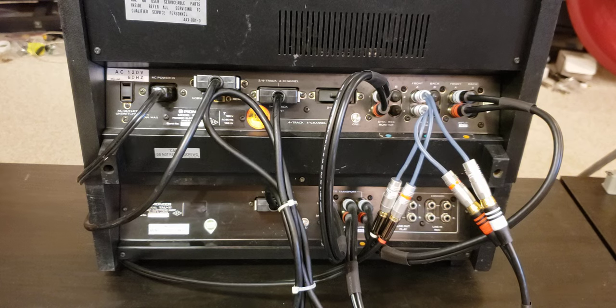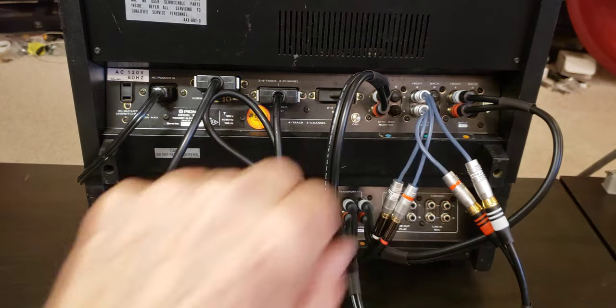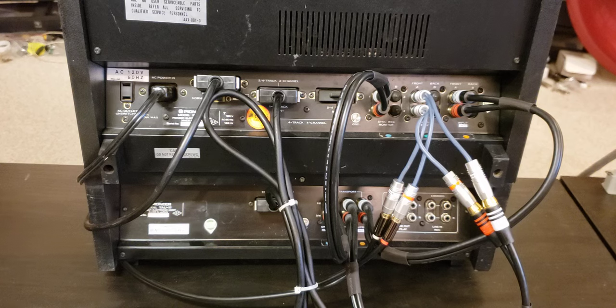And there are two ways of doing it. One way is simply to plug an external amplifier into this connector. That will work marvelously well. The only issue is that you have a little bit less signal than you get out of the line output. So your preamplifier might have to work a little bit harder. This is not a problem for most normal amplifiers, which have a lot of gain adjustment. Like in my system, I have plenty of adjustment, and that's how I use this machine.